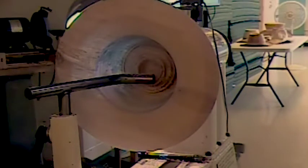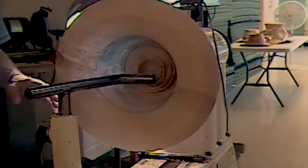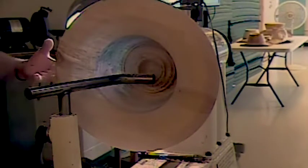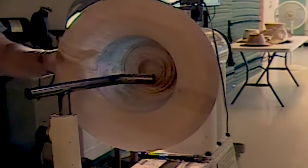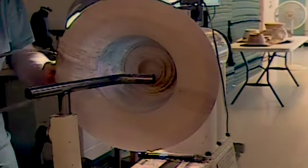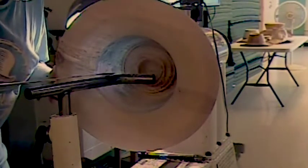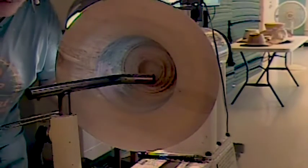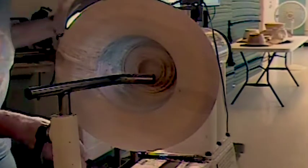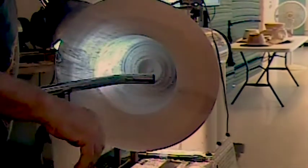And invariably there's some little lumpy stuff. And this cylindrical shape is firm enough by virtue of the shape. I don't need thickness for it to be stable for a final cut the whole way. So I'm going to work to try to make this about 1/8 inch thick all the way, and then sharpen the tool and take one final pass on the whole thing. I'm a little over 1/8 right now, so I'm going to shave that down 1/32nd and then continue further up.